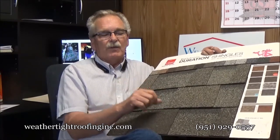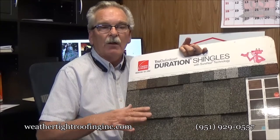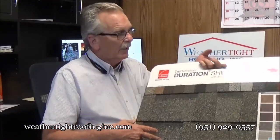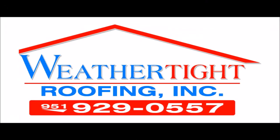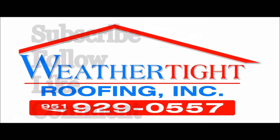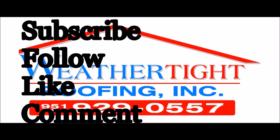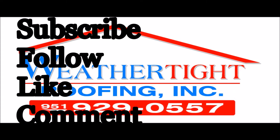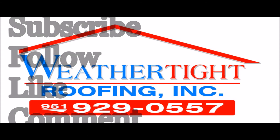You should always have, every couple of years, somebody get on your roof and clean off the debris. Debris is the death of roofs — it causes damming, causes the water to run differently. Mud builds up, holds moisture onto the roof longer, and it causes decay of the roofing system. So you want to make sure your roof stays clean and maintain it anyway, even though this is a maintenance-free roof. It is very nice to know your roofing system.